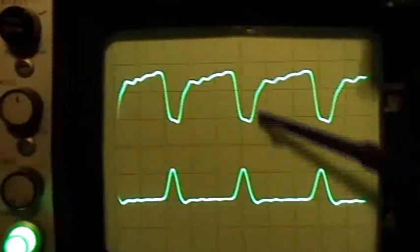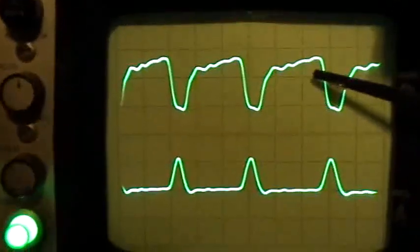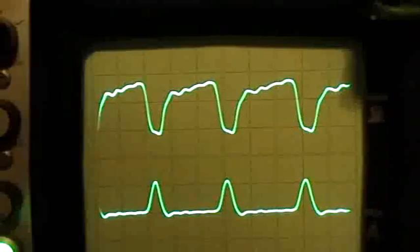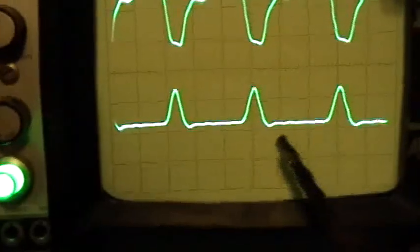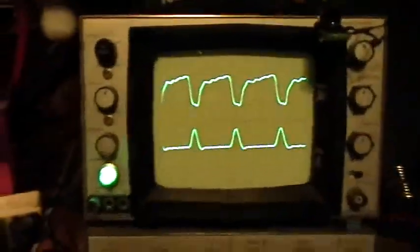This is being displayed at a tenth of a volt per division on the current viewing trace, using a 1-ohm to 1.1-ohm current viewing resistor. The battery trace is displayed at 20 volts per division, and its baseline may have drifted slightly. The baseline for the battery trace is at that graticule division right down there. Thank you for watching — the pocket over-unity demonstrator, all in an Altoids box, completely self-contained except for the oscilloscope.